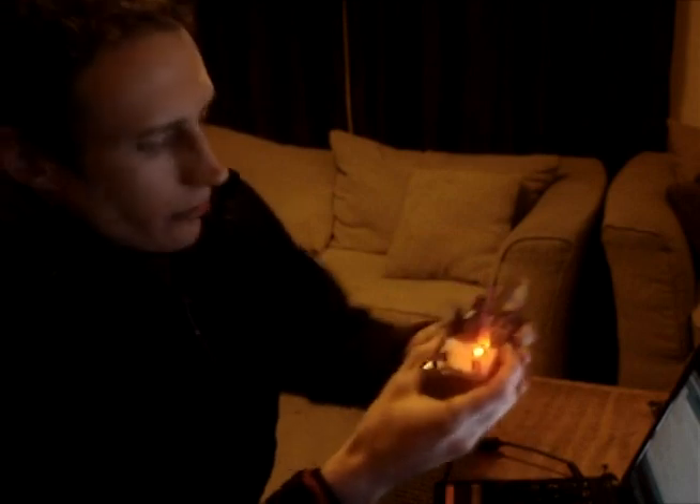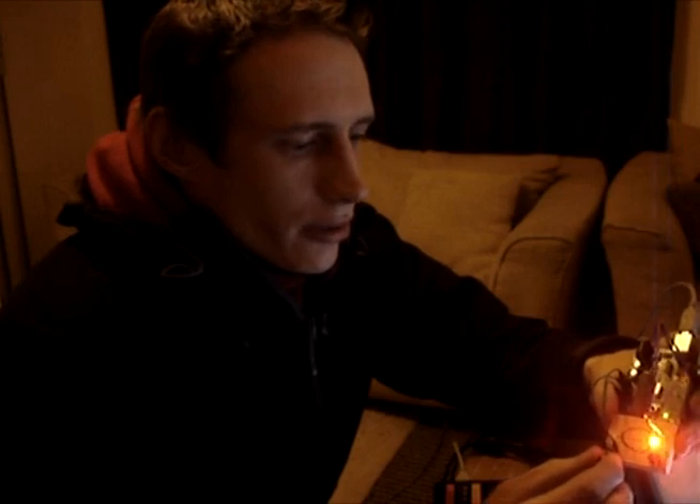Let's just show you this demo that I've got set up. As I turn the potentiometer, or the variable resistor, or whatever you'd like to call it, you'll notice the red LEDs start to flash faster. And then if I increase it, it now looks like the LEDs are consistently on. But what in fact is happening, each one is being switched on and off so fast we can't pick it up with our eyes.